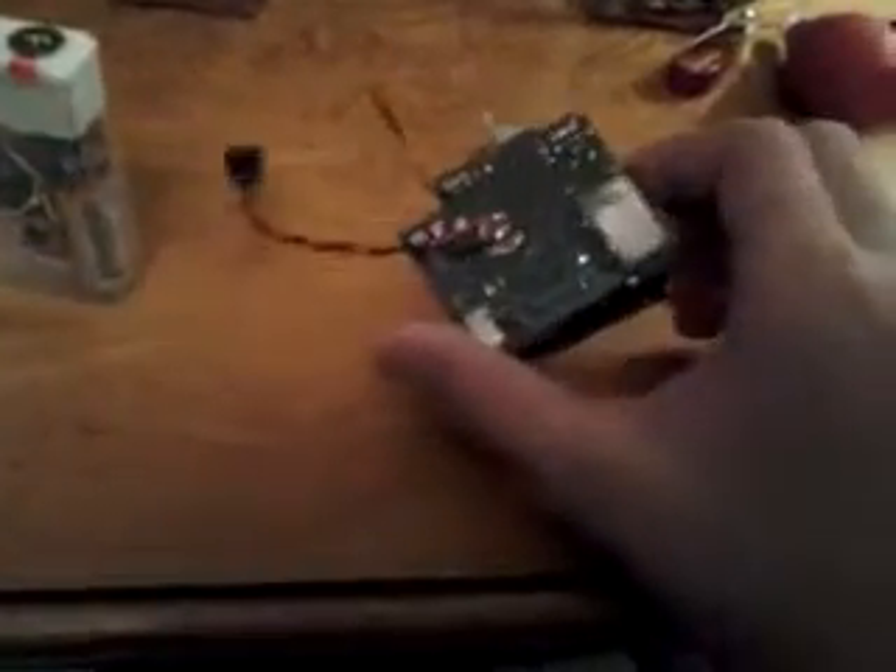I used a smaller camera board this time — not a Kodak, some other brand like a Fuji or something like that. The board was small enough to fit inside the Tic Tac container with a battery. I just have an old battery connector spring there and one up top to power the circuit. I also took a normal push-button switch and connected it to the button on the bottom of the circuit that starts the charging of the capacitor so you can take a picture. This circuit was too big, but it works under the same principle — you press the button, it turns the light on, and it sends 300 volts to where the cap used to be.